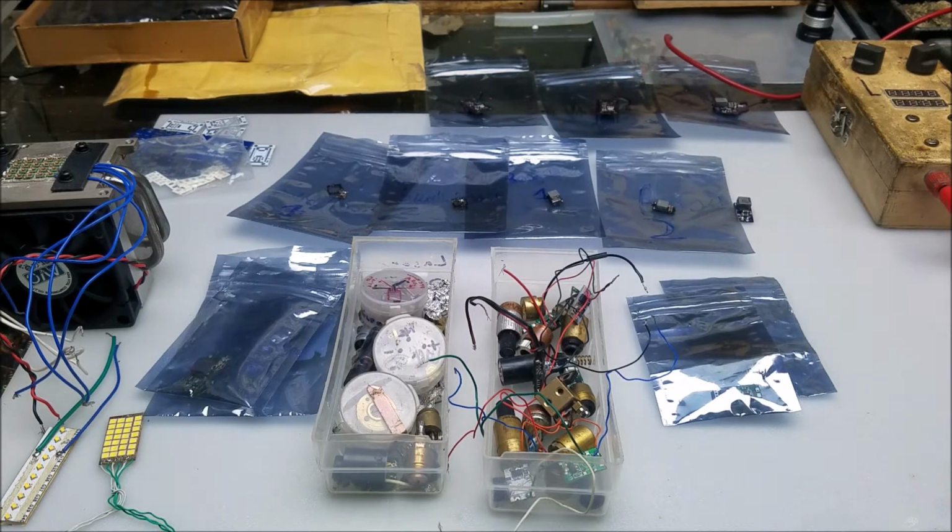The most important thing I'll be checking in this video is Giannis' laser diode driver's capabilities to hold and maintain a constant current, because that is very important when you're working with laser diodes, as they're incredibly sensitive devices. Now, there are two main ways to make a laser diode driver. The first one is a linear configuration, and the second one is a DC to DC converter configuration, which Giannis has used. To explain the difference, let's first go over a linear laser driver.